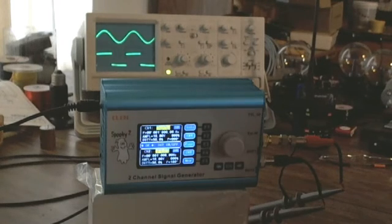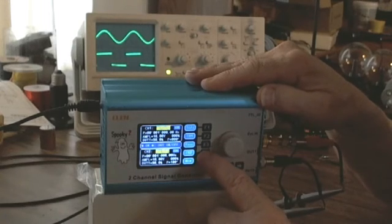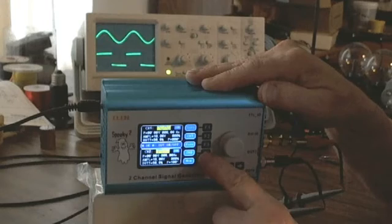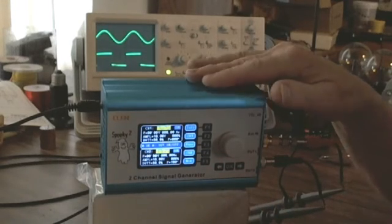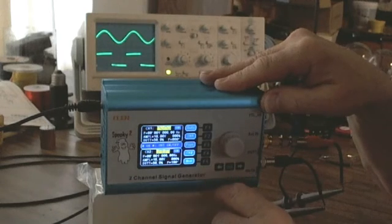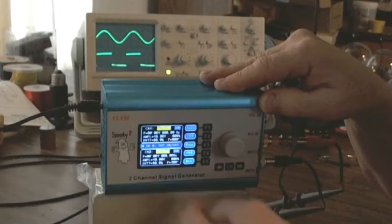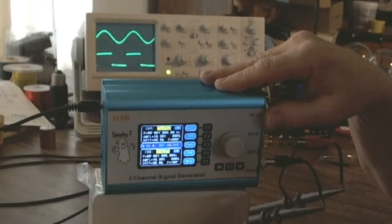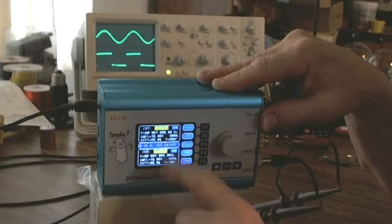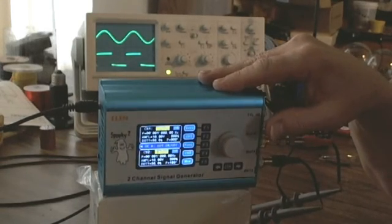Going back to the reference screen by hitting F1 twice — there's my OK again. So I can change amplitude, phase, offset, duty cycle, wave, and frequency, depending on which channel window I've decided to start with — channel 1 or channel 2. Now I want to jump to invert sync.